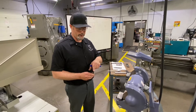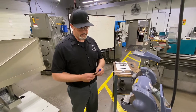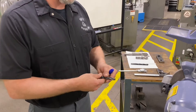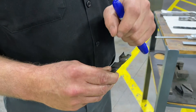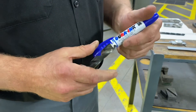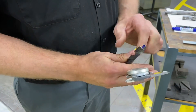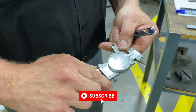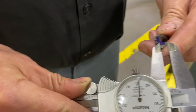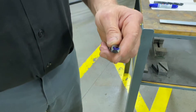Now that the end of the drill is perfectly flat and perpendicular to the margins, the next step is to create the first cutting angle on the lips of the tool. We're looking for between 8 and 10 degrees. I'll put a small reference line in the center of the drill using Dykem — just bluing up the end — and then set my caliper to 250 thousandths, which is half the diameter of the half-inch drill, and lightly scribe a small center line on the point as a reference for placing the edge of the grinding wheel.